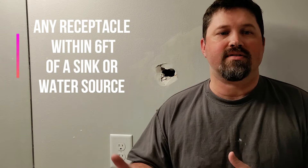Now, that doesn't necessarily mean that a GFCI outlet is required in all those locations — it just means they need to be GFCI protected. So don't go running around your house thinking you need to replace all your outlets because they're not GFCI outlets. In a lot of those locations, GFCI protection can be accomplished through a standard outlet that is downstream of a GFCI receptacle.